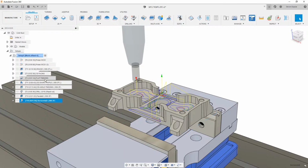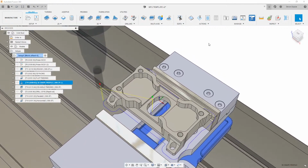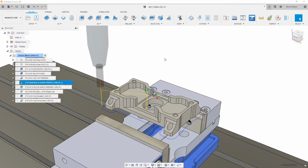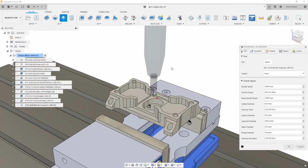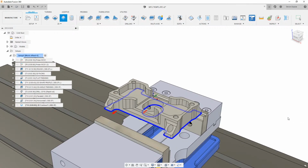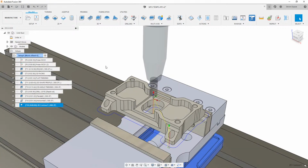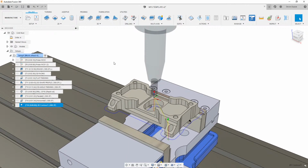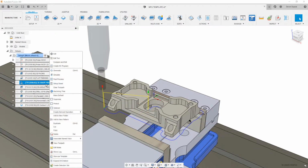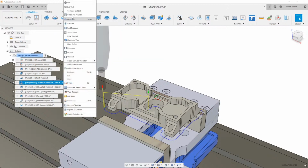Moving down here for the shape, right? I cut the outside of this part and the inside of this part. And this is really easy to do inside of Fusion. We can go to 2D contour and make these selections just by picking here and here, and we can get a toolpath, right? It's actually the same toolpath that we got with mine, except mine I didn't do any selections on. So really with this 3D shape profile, it's nothing special. All I did was use the contour toolpath and give this a big step down.